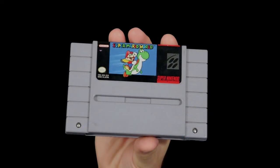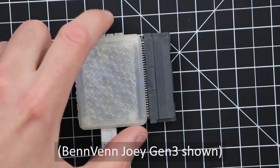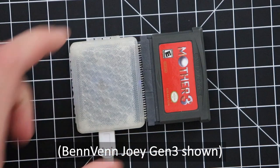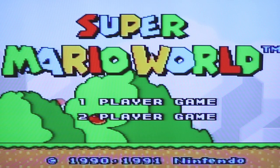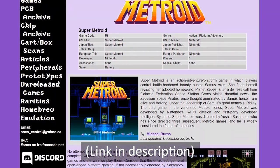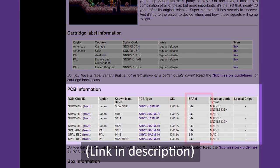Amp mentioned to me that he is open to allowing people to purchase these kits outright, so long as they have the needed tools and experience. Amp very kindly sent me the kit for replacing the SRAM in a 16 kilobit cart, so for this tutorial I'll be installing it into my copy of Super Mario World. However, I won't be moving over my saved game data to the new FRAM module, since I lack the hardware for transplanting the save data. To find out which version of Amp's FRAM kit is right for your Super Nintendo games, check out the website SNES Central, where you can see which size of SRAM your game cartridge uses — I've included a link in the description below.